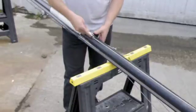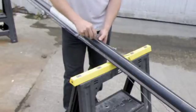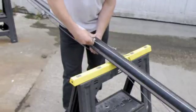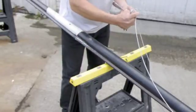For the trapeze lines you can either unscrew the shackles and leave the bolt in place as the new topmast is supplied with a new bolt, or you can just simply take the 10mm bolt out and switch them straight out. You put the bolt back together, which saves things getting twisted when you put it back together in a minute.